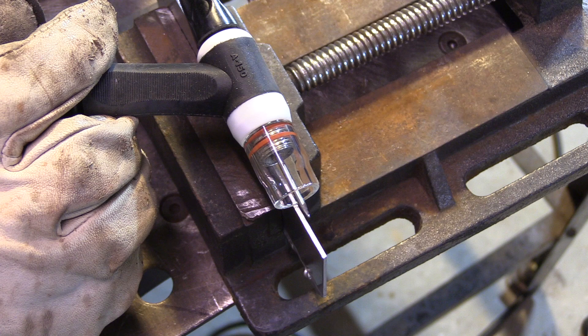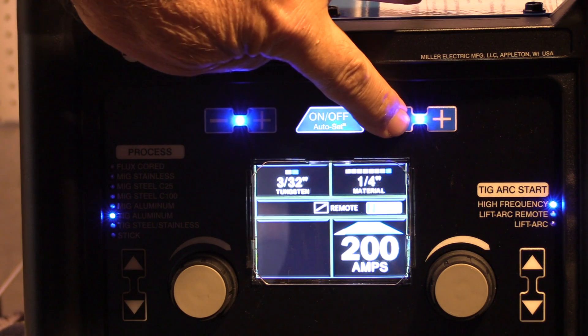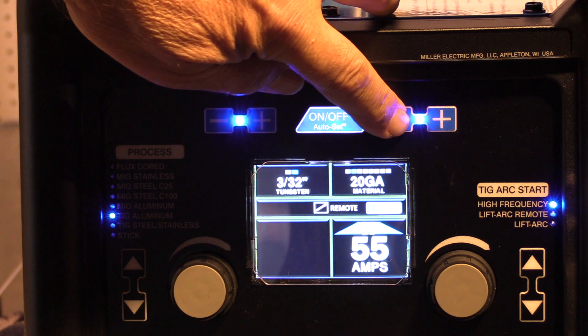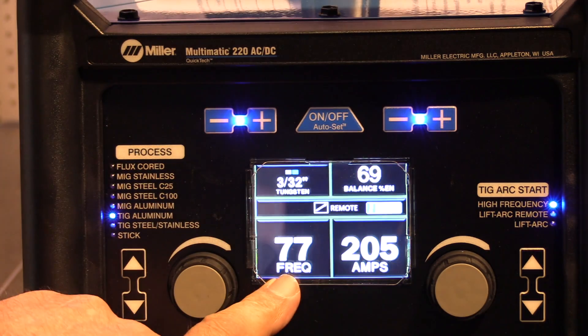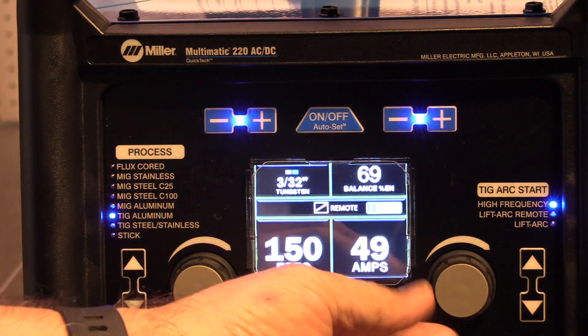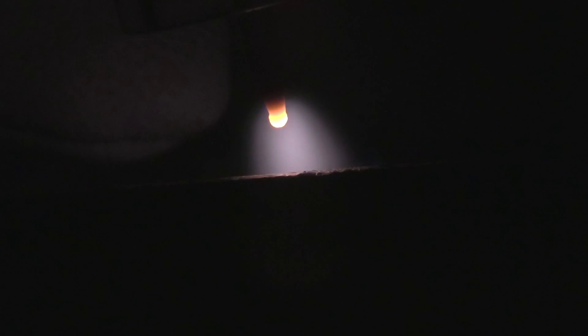To test the low end on AC, I'm going to light up on the edge of 063 aluminum. I go to TIG aluminum — it reminds me where to plug my ground in. Using the auto set only takes me down to 95 amps on 16 gauge, and I know that's going to be way too much for the edge weld. So I bump it down to 30 amps and take it into manual. I want to set the frequency higher to focus the arc — 150 frequency is going to work a lot better on an edge. I bumped the amperage down manually to 30 and left the AC balance on 69% EN. I sharpened the tip just as if I would weld steel.